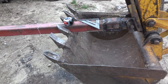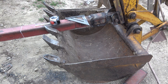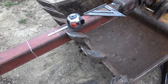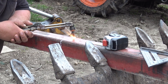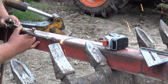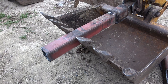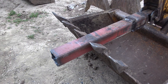This is what I came up with on the length of the thumb — it's going to come out to that white line, which is 34 inches. It seems like a pretty good length because when I raised up the backhoe and curled the bucket down, and with the bucket opened up, that's about where it should be at. I'll go ahead and start getting this cut off and then figure out what we need to do to build the rest of it. I'm going to hop in the machine and move the bucket around and make sure this thumb lines up with the edge of the bucket and everything is good to go before I get it finished.